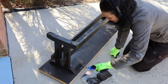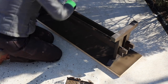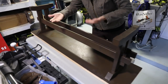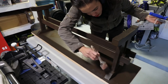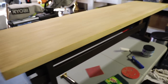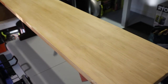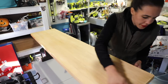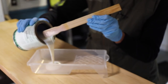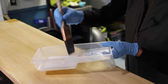It was really, really cold the next day. I had to pull out the work gloves and move as quickly as I could just to get this thing done. Once I had two coats on it, it looked really good. I took it inside the garage, flipped it over, and then I could figure out — okay, what in the world am I doing with the top of this bench? The sanding left a lot of dust, so I had to use a tack cloth and wipe that all away before getting started on putting the top coat.